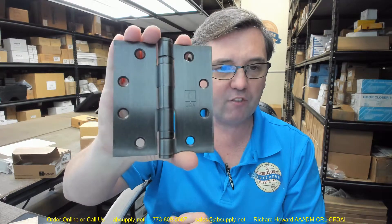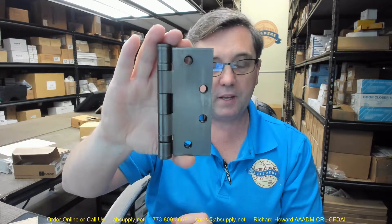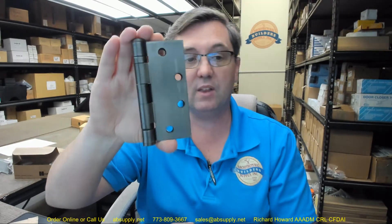This hinge is a little less common in the door hardware industry because it's four inches wide — it's a four and a half by four. However, a four and a half by four is probably a size that ought to be used a lot more commonly than it really is. Typical distributors, us included, carry the four and a half by four and a half as the common hinge. But whenever you have a four and seven eighths throat knockdown drywall frame going over a typical partition, or any condition where the wall and face of the frame are basically flush or the jamb stands proud by half an inch, a four inch wide hinge would be more appropriate — assuming you don't have some requirement like chair rail or an unusual circumstance.